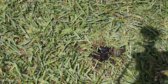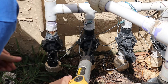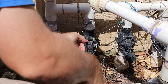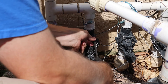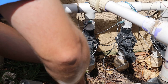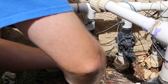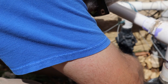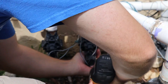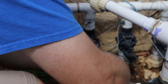The next step is going to be to take the valve apart. So we're back at the sprinkler pump — let's start taking the valve apart. I'm just going to use a double-head screwdriver and loosen these screws and we'll see what we see. Hopefully just a piece of dirt. These valves are not that old — they're maybe four years old or so. I think I mentioned before, these are Rainbird DVF valves — they're about 20 bucks a piece, not all that expensive.